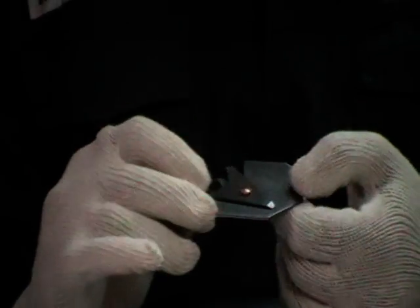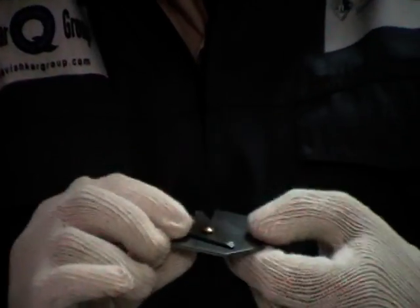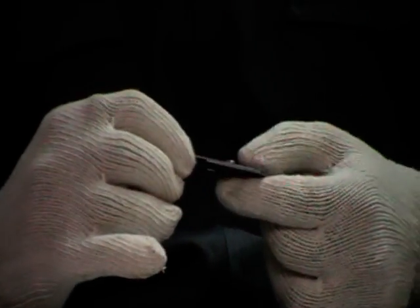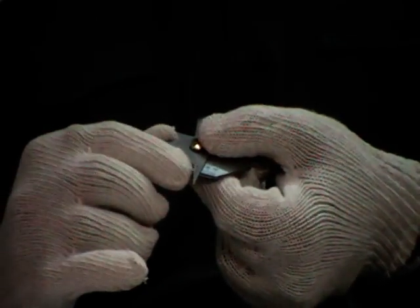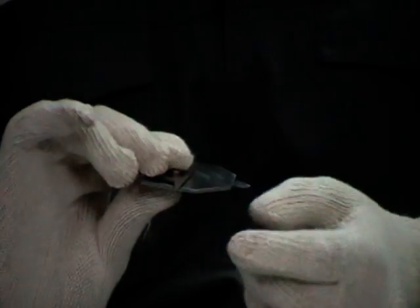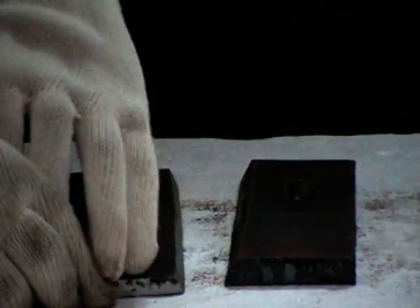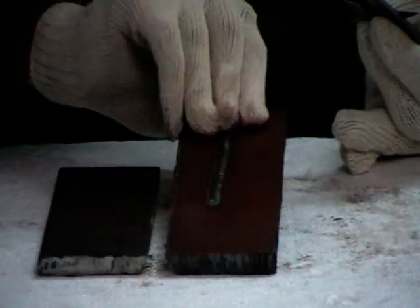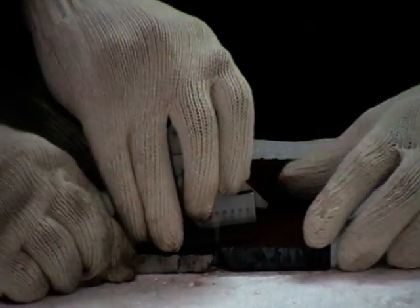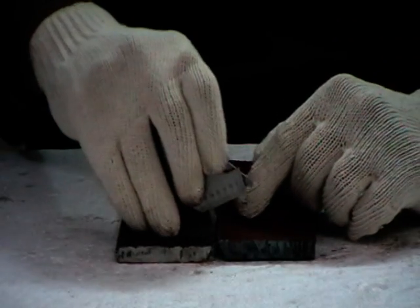On this side, you will be able to see a normal scale starting from 0 up to 35mm, which you can use for measuring just like a scale. There is one triangle which is moving on a central axis, marked from 0 to 5. This can be used for setting up a test coupon — to measure the root gap. For example, if I want to set up a coupon for 3mm, I insert this gauge in the gap and maintain a gap of 3mm throughout, then do the tack welding. So this particular element is used to set the root gap.